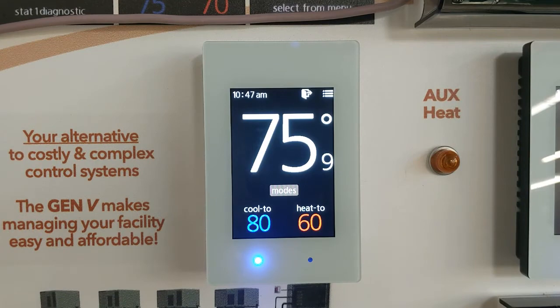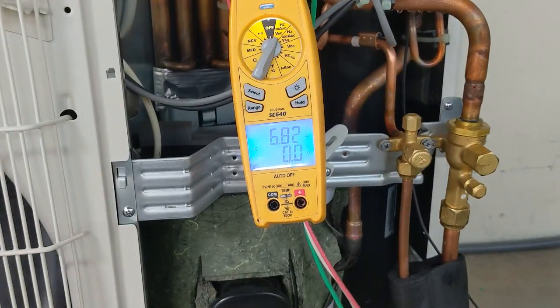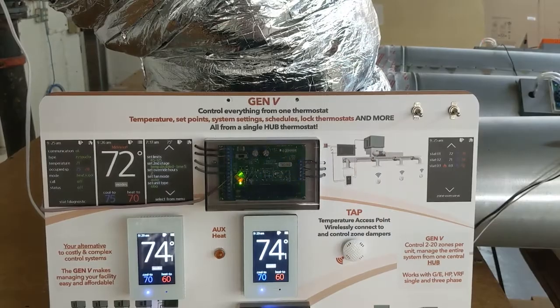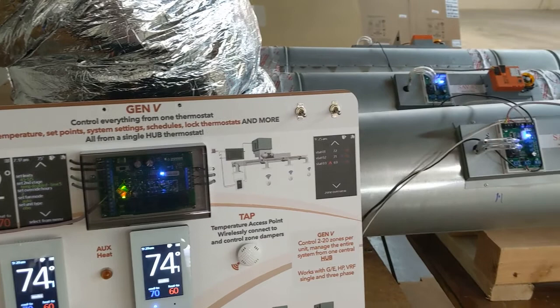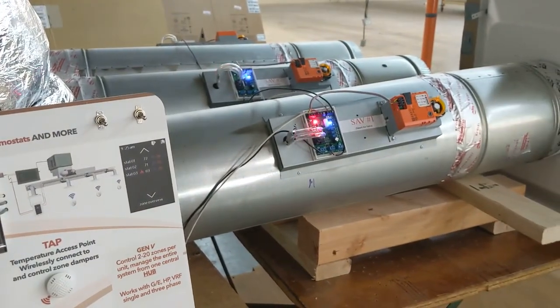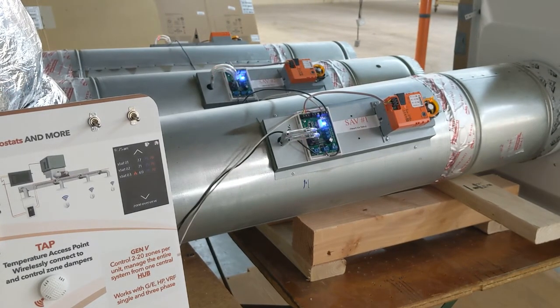As you can see, with just 1 zone calling, the outdoor unit is currently drawing just under 7 amps. We are now at about 50% of power consumption compared to when 2 zones were calling. This system is designed to reduce compressor power and power consumption just like a cassette, based on changes in airflow and the SAV's control of the fan volume.